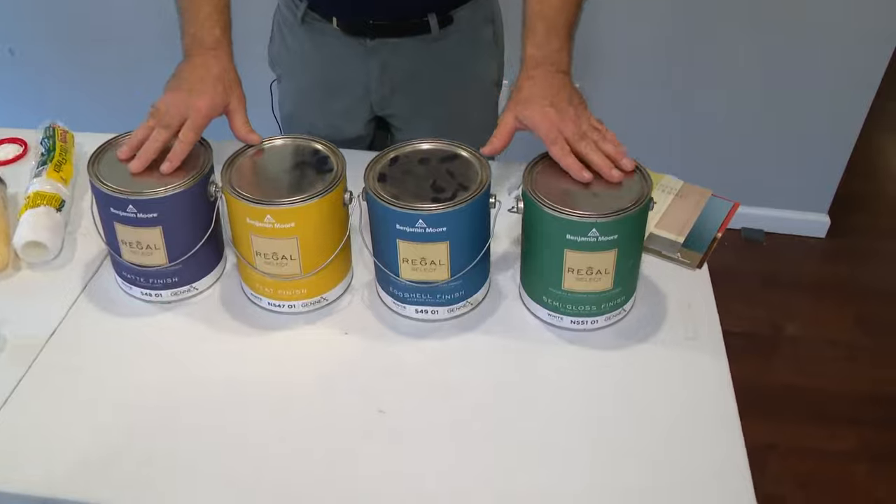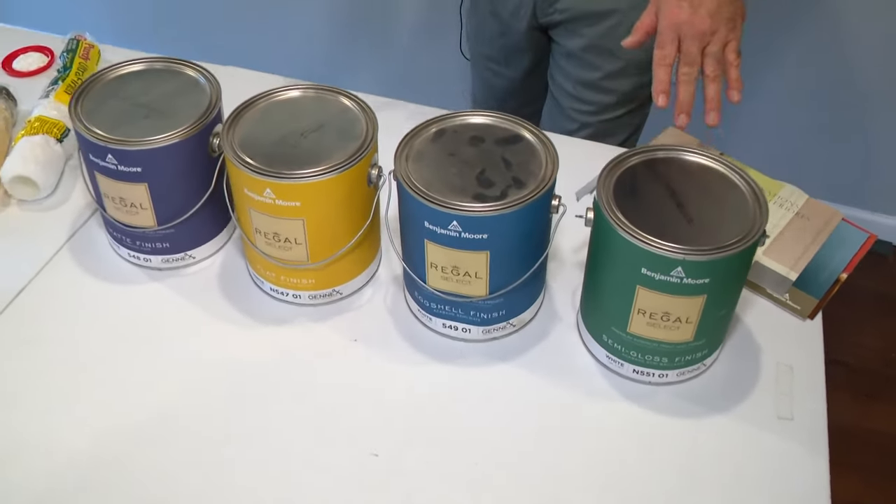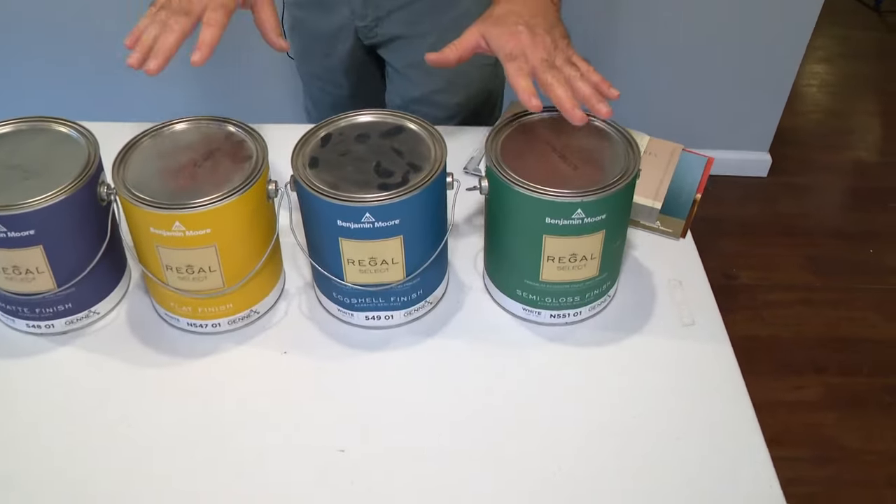As far as the paint goes, get something good quality — the best quality paint that you can afford. On walls, look at your walls and say, 'I live in a 1920s house and the walls are crooked and chipped.' Make sure you use a flat paint, dead flat, because flat tends to hide all those imperfections. But if your walls are in great shape, you might want to use a matte finish or an eggshell, because that gives the richness to the color that you don't get with flat.